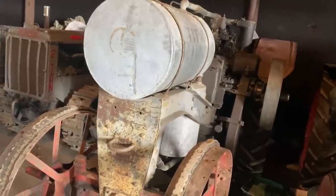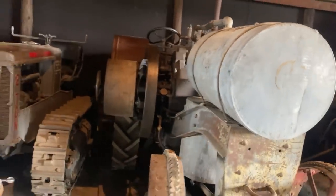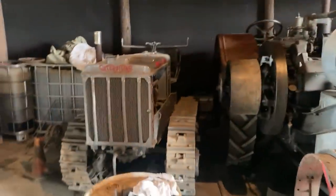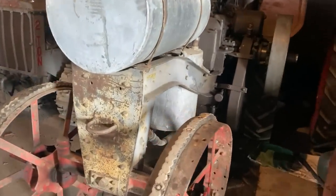Again, this is an International Harvester 1020 Titan — that's how you start it, make sure you park it, and close your oiler off. This particular one likes it — it'll run rough at the start with a turn and a half open, so once it starts to warm up you're going to want to turn that in a quarter or half a turn. It'll take a little bit of experimenting because every tractor is different. We got a lot of antique tractors here and will probably have some starting instruction videos on them. If you liked it, subscribe, and everyone have a good day.